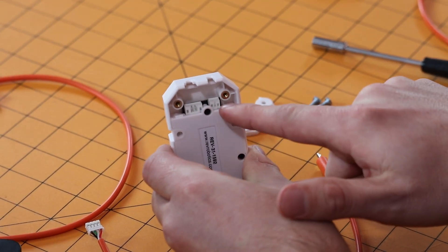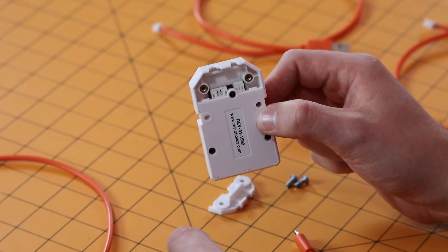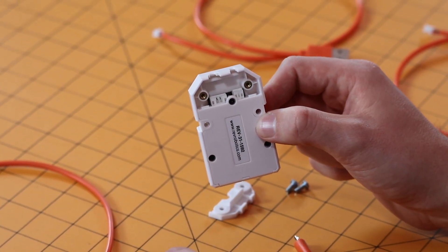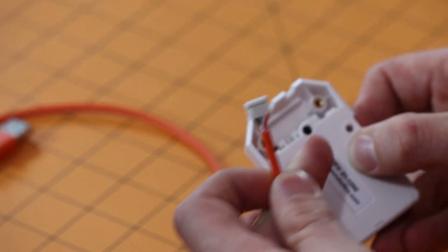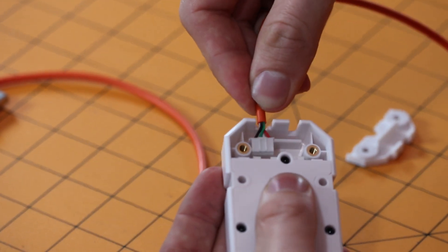There's both a 4-pin and a 2-pin JST connection. Inside your Ultra USB kit you get two different options for both power and the communication connection. For connecting to our robot controller phone and using this with the expansion hub to power a webcam, we're going to use the micro USB cable as well as the 2-pin DuPont connector. Let's start by plugging in our 4-pin JST into its proper spot — find the appropriate cable with the 4-pin JST connector and plug it into the 4-pin port.